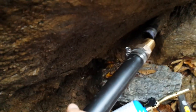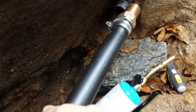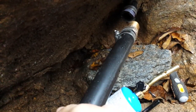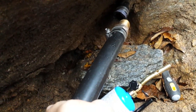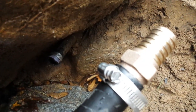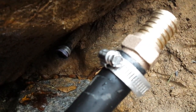Do not use compression fittings. Also, do not use PVC piping — that's not allowed. Do not use CPVC unless that's what you already have. Take a sample of your broken piece to the plumbing store to get the exact same type. PVC does not sustain the pressure. For the recap: use stainless steel clamps and brass couplers with the nut showing. There are versions with the nut not showing — do not get those. The nut needs to be showing so if the house is ever inspected or sold, they'll see the brass and the clamps and you'll be all set. If you have plastic fittings in there, you'll have to redo it.